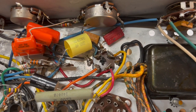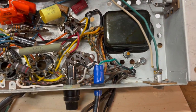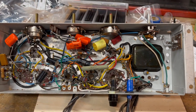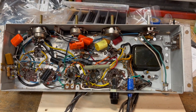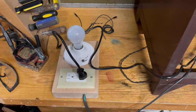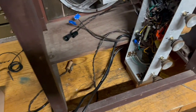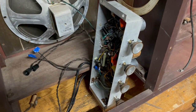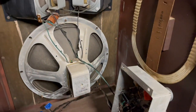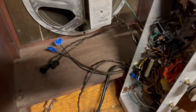At this point it was time to do some testing, because it did work when I first plugged it in with no repairs, so I just wanted to make sure it still worked with the new coupling caps. Here's my testing setup — you can see my light bulb current limiter there, plugged into the chassis rested up against the cabinet so the speaker wires can reach their connections. And as you can see there was a pretty vast improvement already.